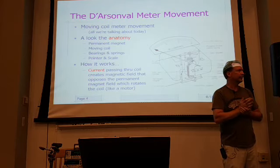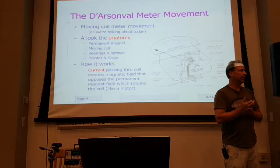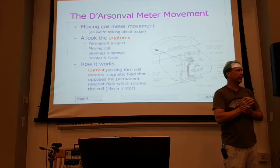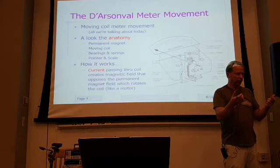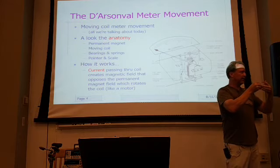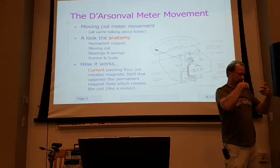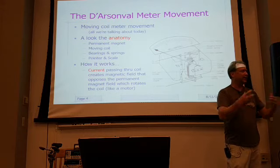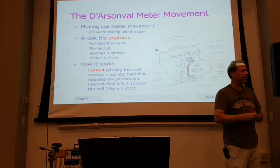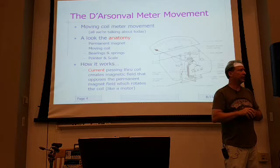And I don't know if you've done restoration of things. The only one that I've done, I bought about 2 years ago. I bought a Drake 2B communications receiver, and I did a minor resto. I wouldn't call it a restoration. It was more of a resuscitation. Somebody had been in those radios; the dial lamps are just clipped onto the chassis with little metal clips. If they happen to move and short against the chassis, it shorts out the heater lines of the whole heater string. So it melted the wire in the chassis. I fixed that, and then I just did a little minor cleanup, realignment, recap. But that was the only restoration or resurrection video that I've done.